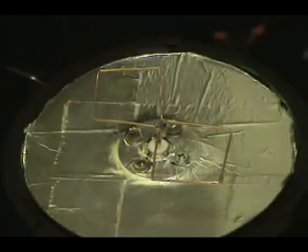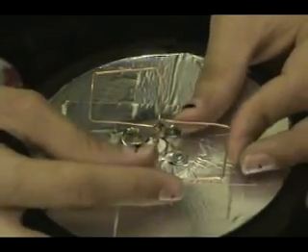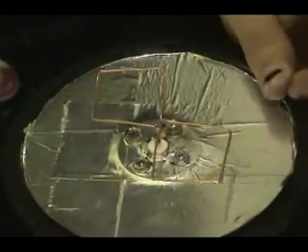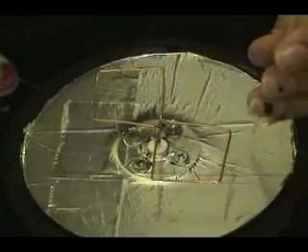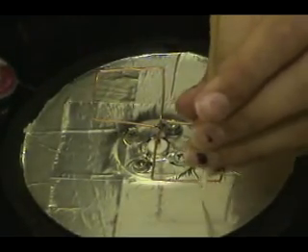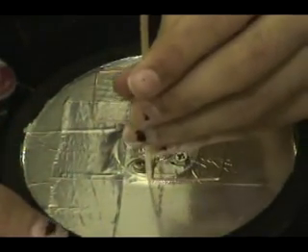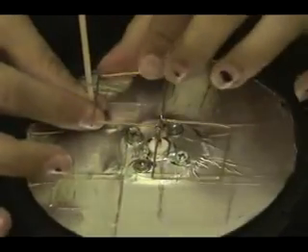And from this point, your biquad's built. However, I would actually sit there and try to re-adjust all of the elements very gently, and then using the meat skewer yet again, you can easily just go along this track and see where you have a low point and re-adjust, making sure that you're one-eighth wavelength apart from the reflector.